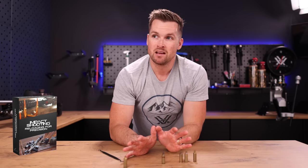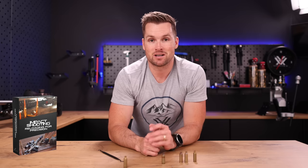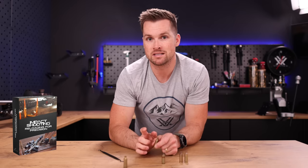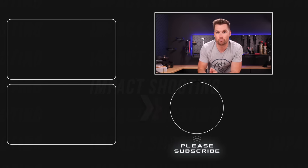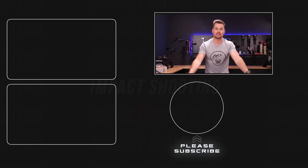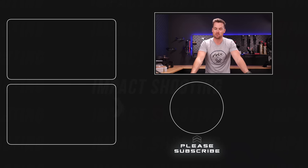So guys, these are some of the things to look out for when you're reloading. Always visually inspect your cases. Take care to set up your equipment correctly — that is the number one thing to get the most life out of your cases. Do you need an annealing machine? It depends how much you're shooting. If you're a competition shooter, probably yes. If you're hunting once or twice a year, probably no. Most importantly, set up your full-sizing die correctly so you're not overworking your brass, stay on top of your cleaning regimen, avoid carbon rings, and you should be off to the races. I've linked the other videos referenced earlier — there is a playlist called The Workshop on my channel. Leave me a comment on videos you'd like to see, and I'll see you in the next one. Thank you very much for watching.